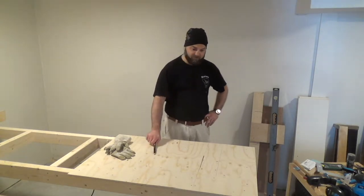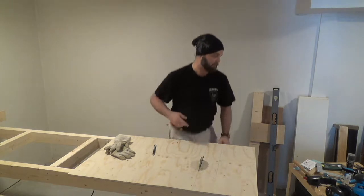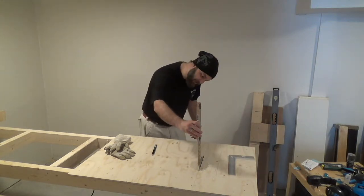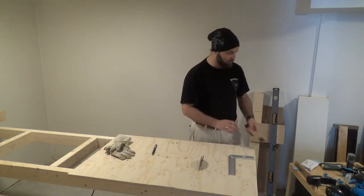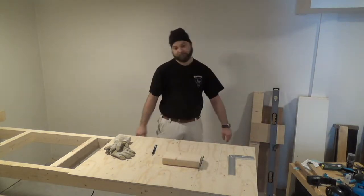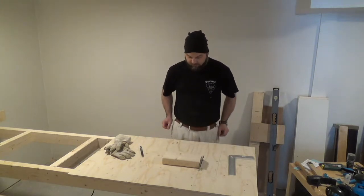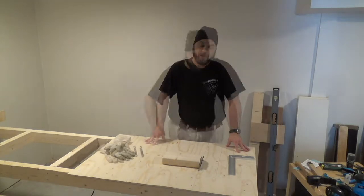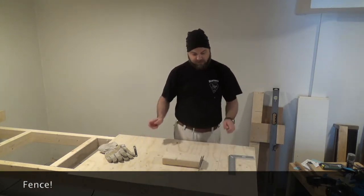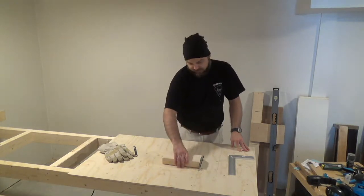I'm really looking forward to it, but one of the problems is that the height of my blade here is approximately 2 inches or 5 centimeters, 5.5 centimeters, but that's 2 1/16 inch. And I want to be able to cut 2x4s here, so it doesn't give me much clearance. I've seen designs where they use a base plate with tracks on them, but I have to use a design that only uses the push plate in the back and maybe in the front, and only the rails, because I only have about 1/16 of an inch of clearance.